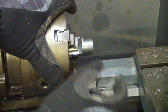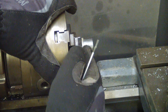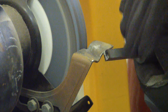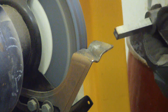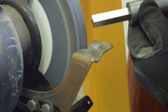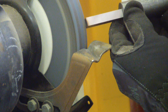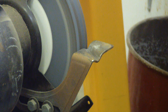So that means there'll be an oscillation of 40 thou. Set the tool cutter four inches down — it'd be, honestly, not much really. I'm not sure if that's even enough. I just hammered my tool steel into the holder and I'm going to do some grinding. On the cutting edge I want it to be a hemisphere, and an easy way to do that is on the edge of the grinding wheel — if you rotate like this, because the grinding wheel is round, you're going to get a hemisphere. You're going to get a dish in there just naturally. We'll try a little clearance to allow it to wobble in the hole.